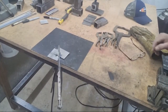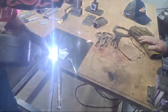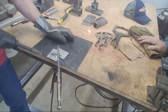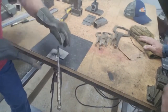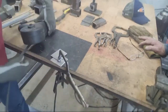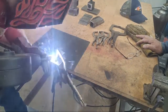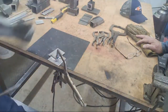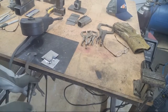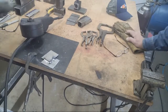Now that I've got the machine set up and it's welding a lot better, I'm going to weld this side. With a spool gun, you're never going to get as pretty of a weld on smaller machines — that's just about the best you're going to get. My machine is a 110, and if any of you ever buy a welder, buy a 220. Because the weld would be strong and hold just fine, but because the machine only runs 110, it can't weld hot enough to get the flow and puddle that I like.